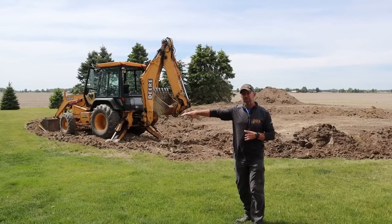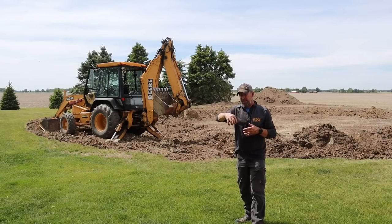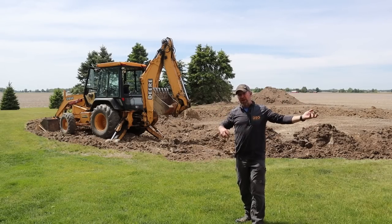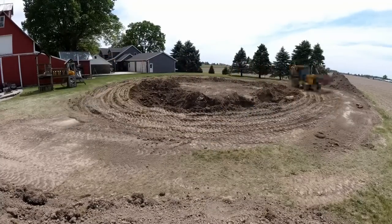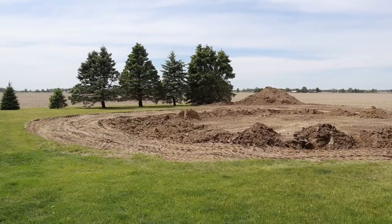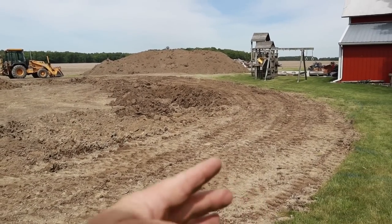I've made my way around the top and dug up clay. I made kind of a keyway around the outside — before I started building the outside back up, I made at least a three-foot wide trench, got down to good clay that had a lot of moisture in it, and then put clay on top of that to build it up. Now I've got that first layer done. I didn't want to build more than a foot at a time so that I can compact it. I'm going to go around and just knock it down lightly with the backhoe.